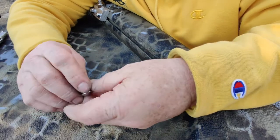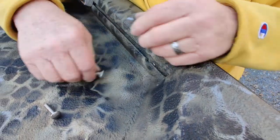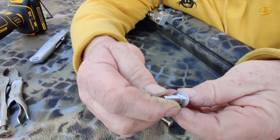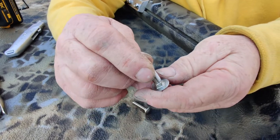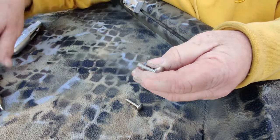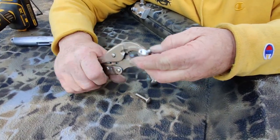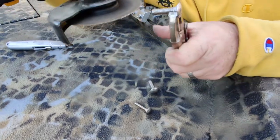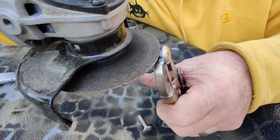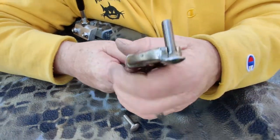So what we want to show you is here's what we do. We take these carriage bolts that don't quite fit in there. I got one here that we already ground a little bit off — we just take and grind one little side off the square. We clamp it in a pair of vice grips, put your safety glasses on, and take a side grinder with a cutoff wheel on it and hit that edge a little bit — put a little flat on it.